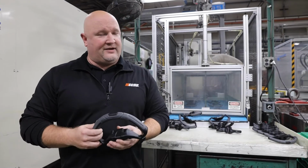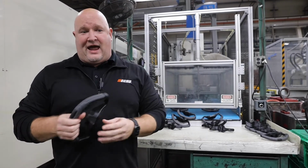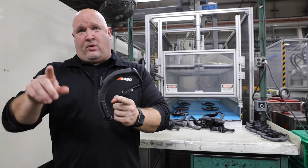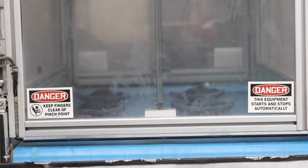So what we said is, all right, we'll start from the drawing board. We'll come up with some new innovative techniques, which you see the mold and the rotation, how it happens. Essentially, we mold the undermold, and then this gray area here, the soft overmold, has a secondary injection unit. Once the mold spins, it injects that over the top of the hard shot, and then we end up with a handle that gets molded all in one shot.